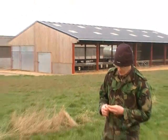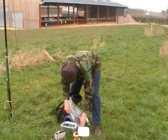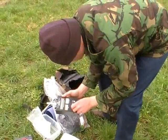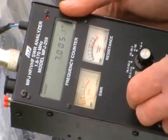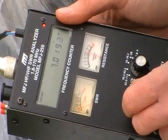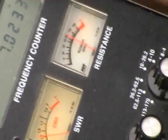I wouldn't normally test my antenna — I know it's resonant — but for the sake of demonstration... Right, we've just gone to the 40m band. Going up in frequency now, and we come to the magic 40m band and look, there I have a low SWR. It's still going to be operating around 7.025 or thereabouts. You can see my SWR is below 1.2 to 1. Superb. 50 ohms.